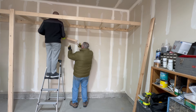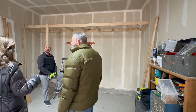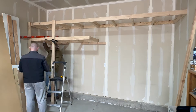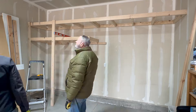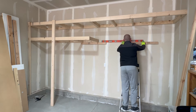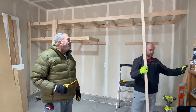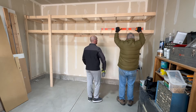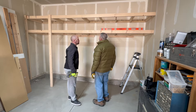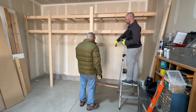Taking our measurement so we know where to put our next set of support beams. On to box three — mounting it the exact same way we've been doing the whole time. We're making sure it's connected to the front posts that are already installed and that those are level. Box three is secure. Now moving the support beam for box four. Just like box two, we're holding up the beams for box four to make sure we get the measurements to fit nice and snug in this area. Box four installed. You need to make sure that everything is level — check your level along the way. First two rows of shelves are installed, and now we're removing those support beams because they're not needed anymore.